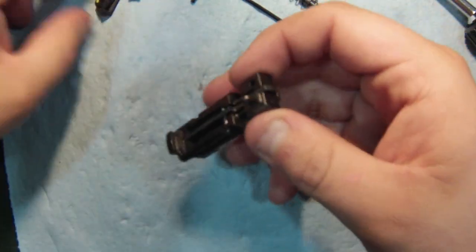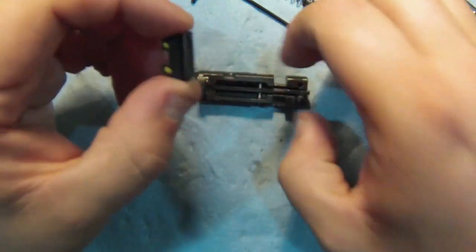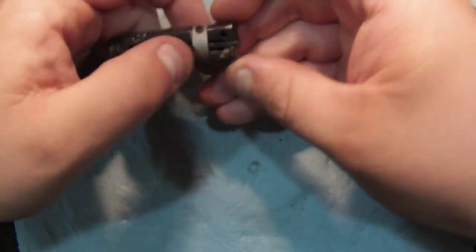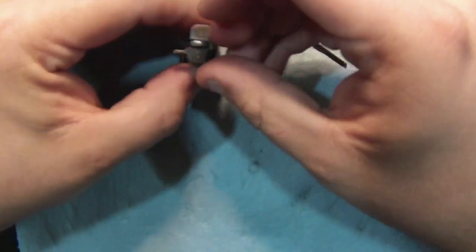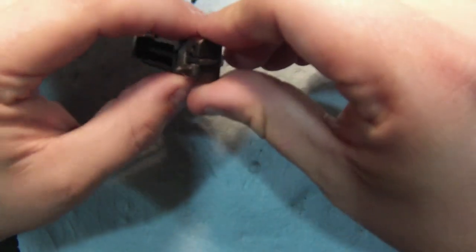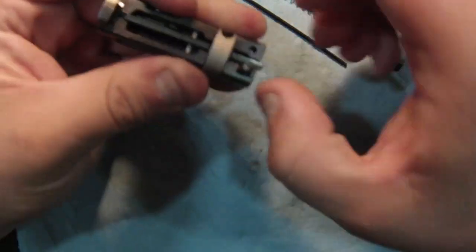And this is the piece that goes up into the sight that screws in there. I don't know if you can see that. And that's what actually holds that breech up into the slide. Now, where the issue is, I believe, is this safety block, which keeps the firing pin from moving forward. I guess if it's jarred with ammo in the chamber, as you can see there, it keeps the firing pin from moving forward.